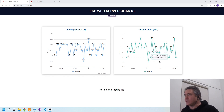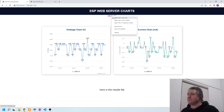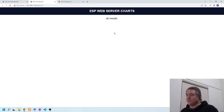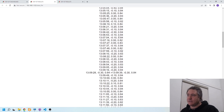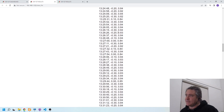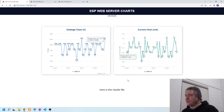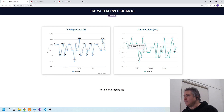It's all being output to a file on the SD card as well. If I want to have a look at the results I can just click on 'get results' and this will bring up all the readings we've taken. We're taking them every 10 seconds, and I've got it all plotted here. This will make it much easier to monitor something all day if it's up on the roof. All the code for this I've put on GitHub and I'll link that in the description. Let me know if you've got any questions in the comments below.